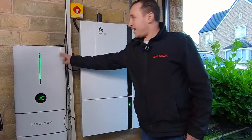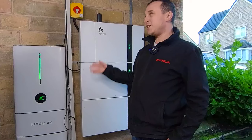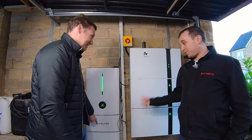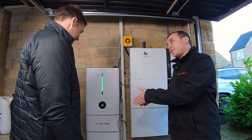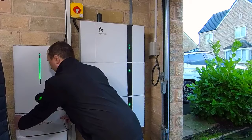This is a bit better looking in my personal opinion — a bit more like a Tesla Powerwall kind of design, prettier. You'd have it on display maybe in your house. So that is the inverter, and then that's a five kilowatt hour battery module. So that's just five kilowatt hours. It's a lot thinner — it's against the wall so there's a lot less depth to it. And it's also a lot slimmer. So this is kind of the same size as one of those just flipped upside down and stretched. This part here is just where the electrics are — all the battery power connections. But this one's a hybrid inverter.